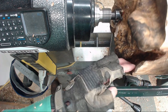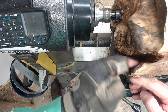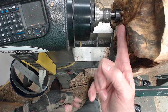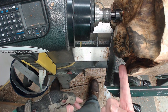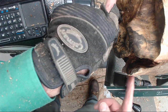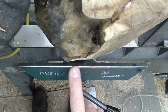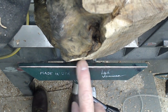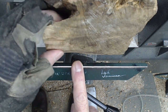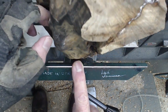Here's a different view of that wing — see, there's nothing behind that wing, so if I cut this down, that wing is going to go in and I'm going to have a big low spot in the rim of my bowl. My rim is going to be out here somewhere. I'm going to move the whole bowl blank in this direction by moving the drive center over about three-eighths of an inch, so that when I do that it bulges out the other side — I'm going to take wood off the other side and protect this wing. Now that I've moved it, you can see right here I'm going to be cutting wood when I make my first cuts, and as I go past over here it's going to be all air space — and there's my wing that I don't want to cut. I'm protecting it because it's away from my cut.